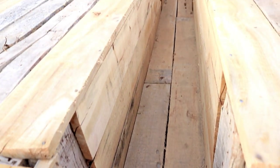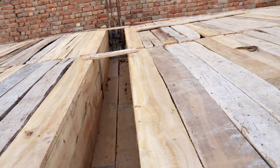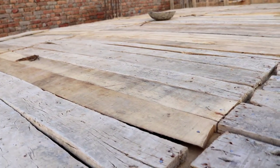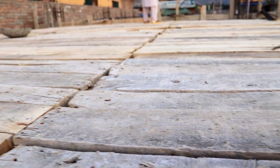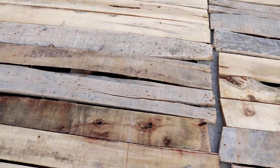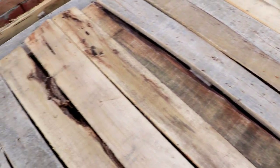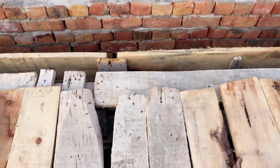You can see the level should be okay. Now here is one thing which is very important: there are different types of buttons, but we should use only one type of button, because if the level of each button is up and down it can create problems in our concrete slab. Using different types of buttons cannot give us good finishing.